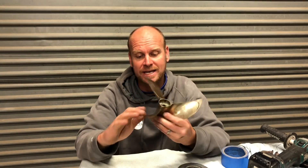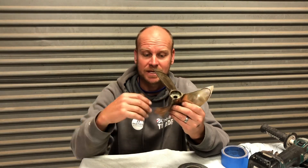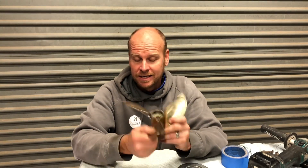If it's still too much pitch, I can start bending that leading edge up a little bit to reduce the pitch, and I can also bend that trailing edge back down a little bit. You've got to start somewhere, so we'll continue on.